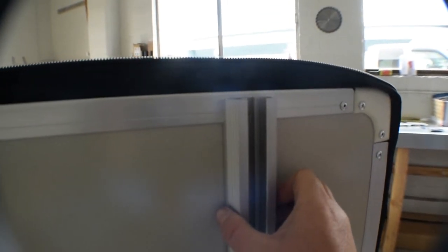And then you will see that the rail is a little short on, so there's about a finger width up here. You can adjust this up and down. What I do is try to split the difference between both sides, or basically the width of the cap that you're going to be putting on. So basically the width of the top of the cap, which is a little over 1/8 inch thick.